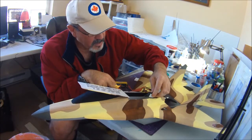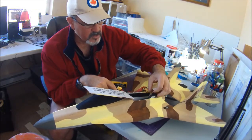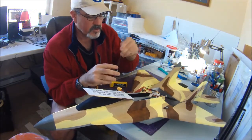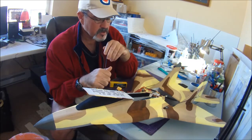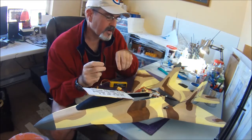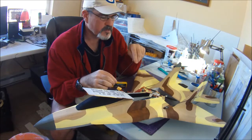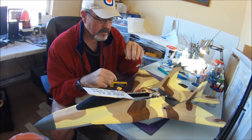Like I said, my receiver is not that wide, as you can see. This is a 6-channel receiver from Hobby King, which is compatible with my Turnigy 9X with ER9X flashed on it. I run my 2 rudder servos into one single channel using a Y harness, and all of my other servos have their own individual channel, which is kind of nice because in the ER9X, and I'm sure on Taranis and some of the more advanced FrSky or other radios, it allows you to fine-tune each one of your servos individually. I guess more advanced Spektrum radios like the DX8 and higher can probably do the same thing. I'm not that familiar with those, but anyway, that gives you a little bit of flexibility.